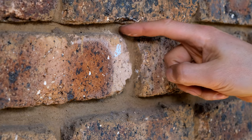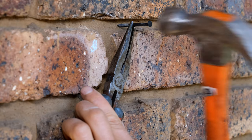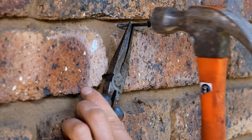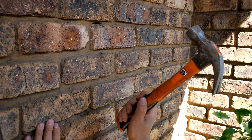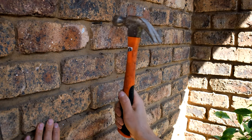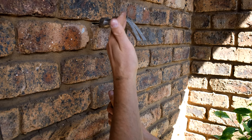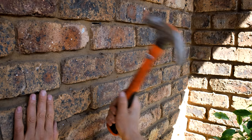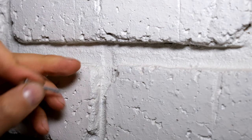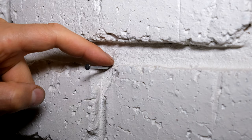If your installation requires the nail to be hit into the cement, you will need a slightly longer nail. Gently tap it to start. As I'm increasing my impact strength, you can see the head of the hammer is going further back. Note that when I strike the nail, my hammer lands in a perpendicular position to the ground.